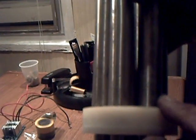What I did is I took a piece of nylon and we drilled it out — we bored it so it was this diameter to fit in my tube, about four inches, and spaced the holes out. So we drilled out three-quarter inch holes with a fly cutter, and that way we could press in a three-quarter inch and then we pressed in a one inch tube.